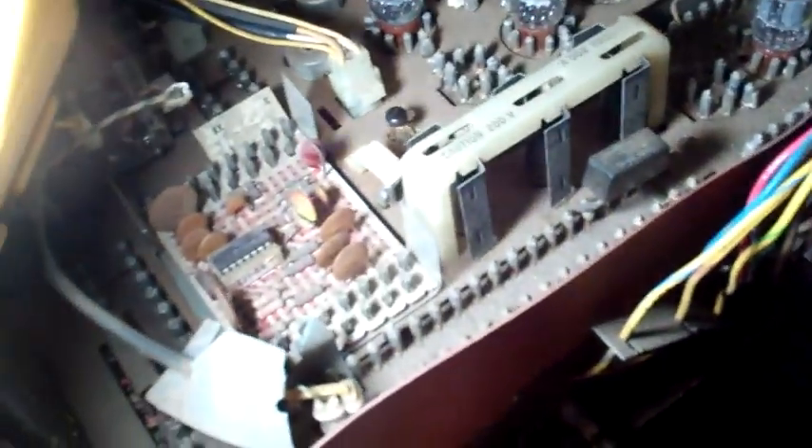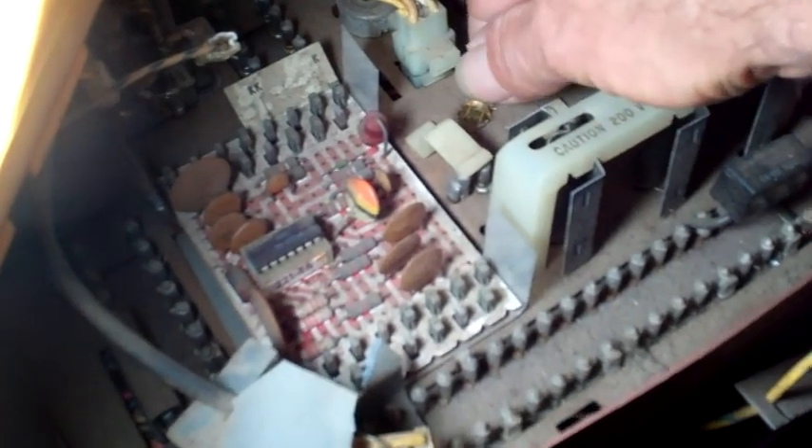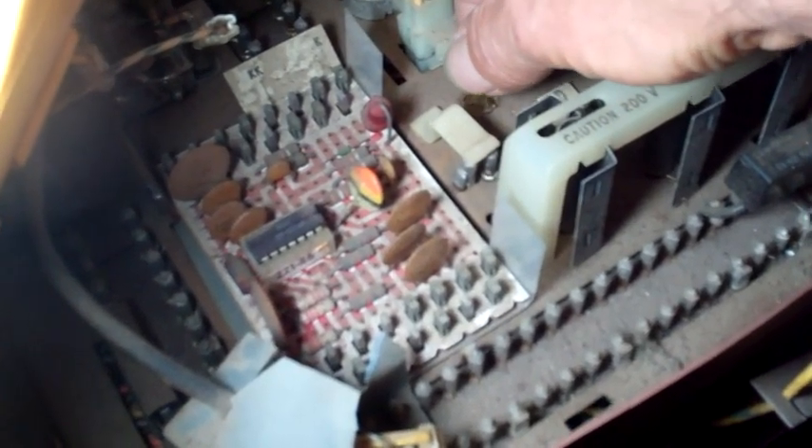So it turned out it was a service switch. I think I've got something still wrong because the brightness control stopped working. And the transistor was bad. Did I put the transistor in wrong? Anyway, there's a real flaky service switch which I'll probably bypass. I tried putting the old white transistor back in and it didn't work.